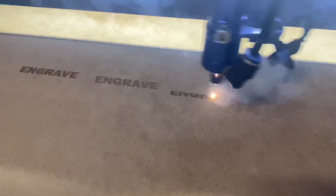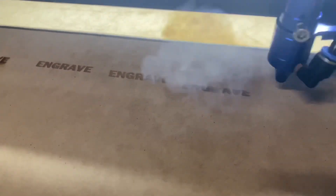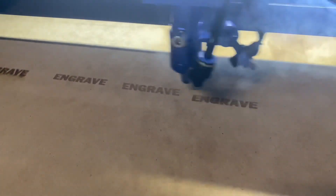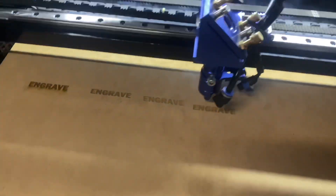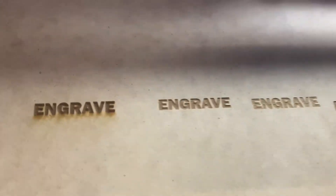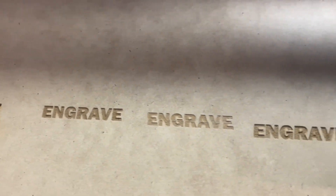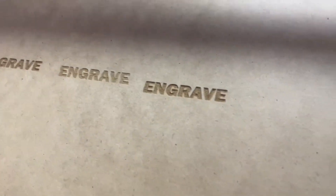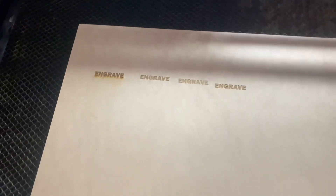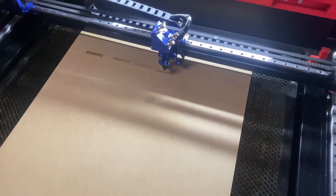Let's run that out and I can show you. Yeah, it's just a good thing to know, and definitely if you do use the controller itself, this is one of the good features that works with this controller. There we go, they're all done. You can clearly see - we've got the dark one at 150 millimeters, 250 millimeters, 350 millimeters all on 25 power, and then the last one at 350 with 50 power. Good little tip there, hope you find that useful. Give the video a like and don't forget to subscribe. Cheers!